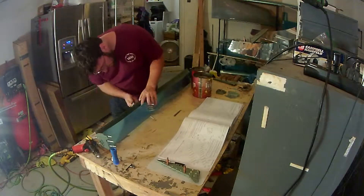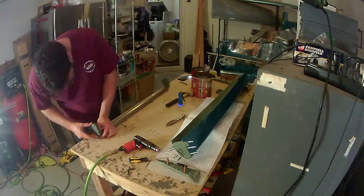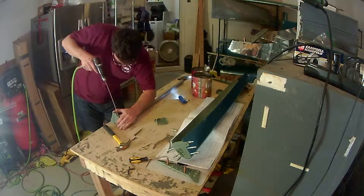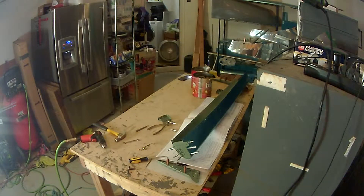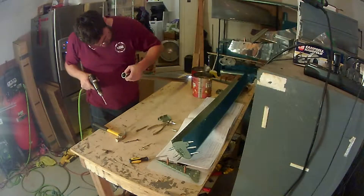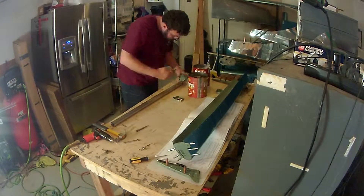Remove the counterweight from the whole piece, then use a drill press — that's what I end up doing. Here I'm marking the locations of the rib holes onto the counterweight, then taking it to the drill press to make those holes. It's important to line everything up and make sure there's no twist, because you need to get those two ribs centered on the counterweight. Otherwise you'll put a twist into your aileron.